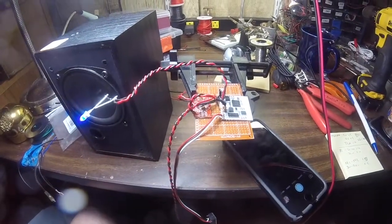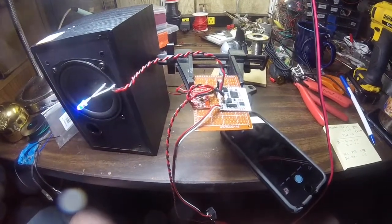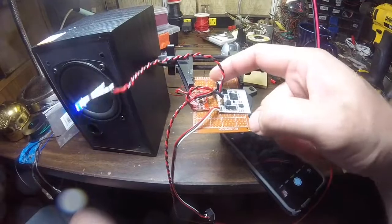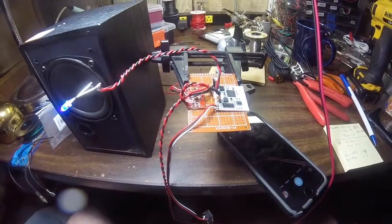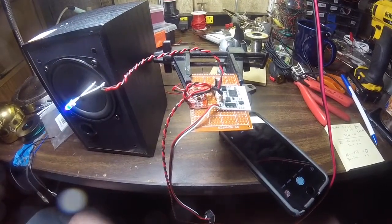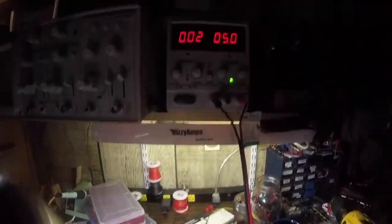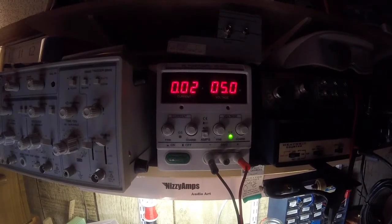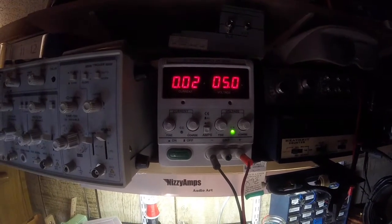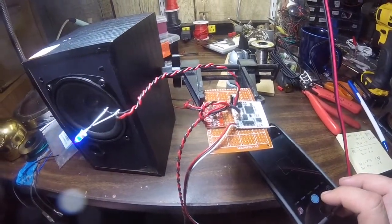This thing seems to be very low noise. I've got it turned on right now and as you can see, I don't have an isolation transformer in here and it is not putting out any noise whatsoever. But probably the most important thing I'm finding is — look at that quiescent current. We are only drawing 20 milliamps at 5 volts. That's amazing. Let me go ahead and throw on some royalty-free classical music and we'll see what happens.